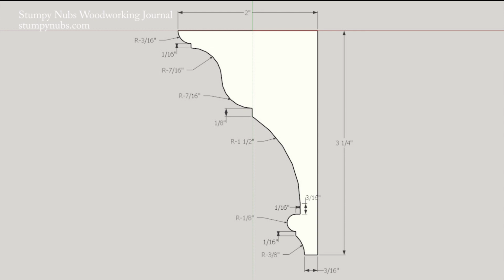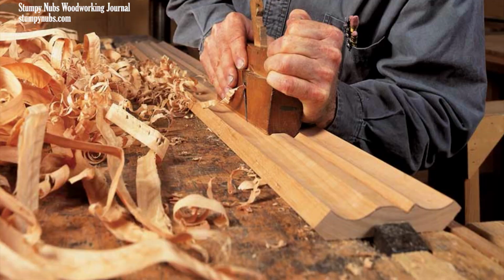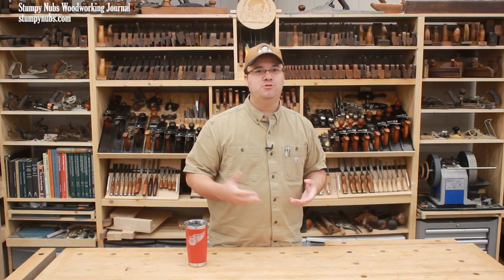flats, or fillets. All those fancy moldings that you see on the old period furniture were originally cut one cove, bead, or fillet at a time using hand planes. By combining just a few basic shapes in these planes, you could make any molding that you could draw.